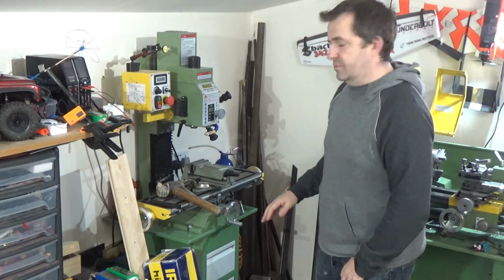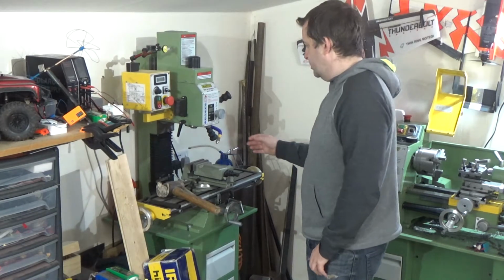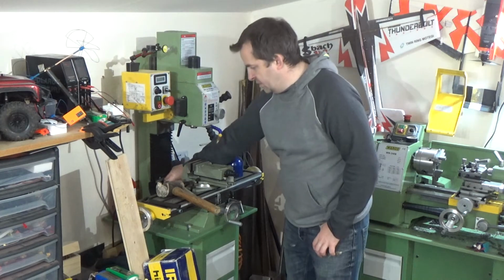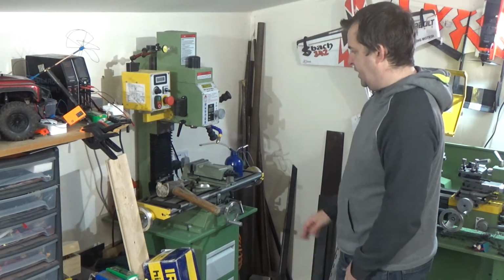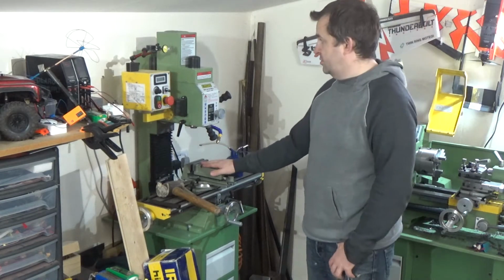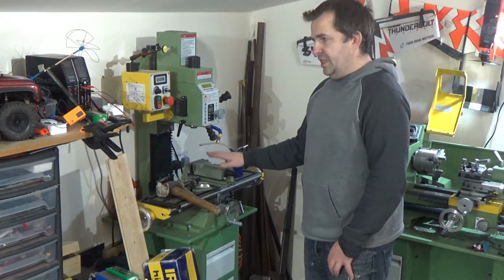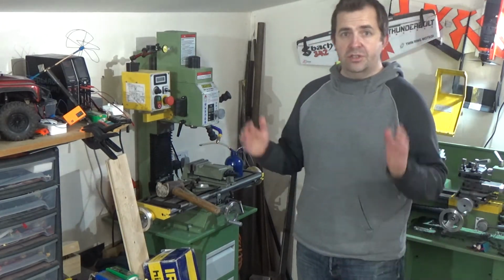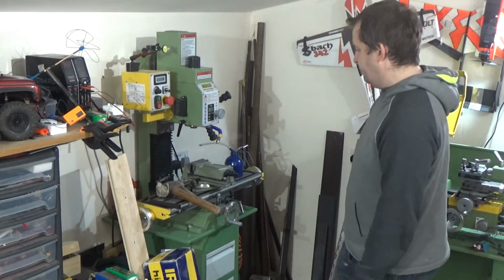So, I put a mist coolant on it. It's not proper water coolant. It has been used. There's chips all in the back there. Again, cracking little mill. Do like it. But trying to do any sort of engineering, slots, hole positions, it's just a nightmare trying to use the mechanical scales on the front.